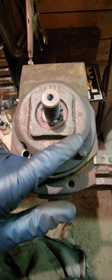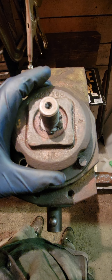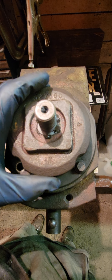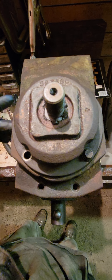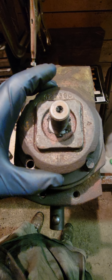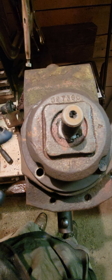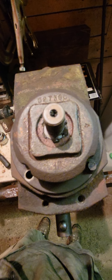There's a bearing behind here too. I didn't replace those bearings — I don't think they really go bad since they're pretty simple and sealed. You can put your finger in here to hold it, or use an old piece of shaft. When you get it on the machine, check the backlash again just to make sure nothing moved or the pod position didn't shift. That's my video — hope you like it, thanks for watching.